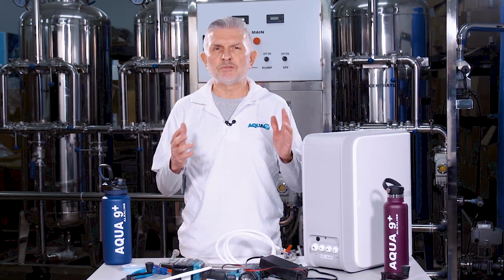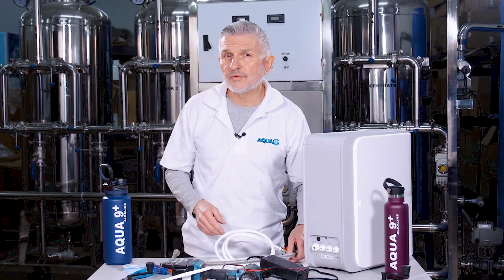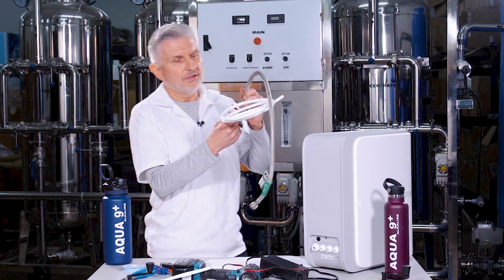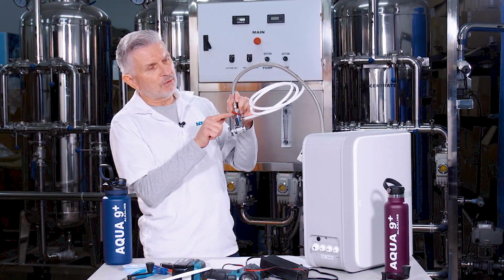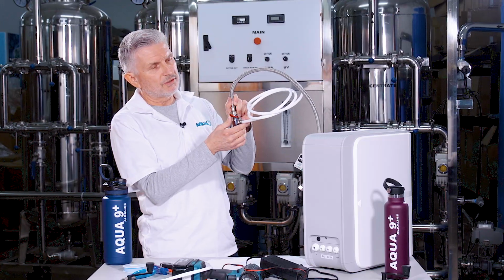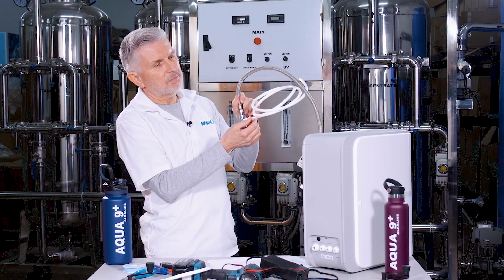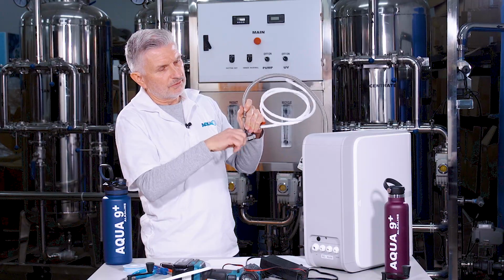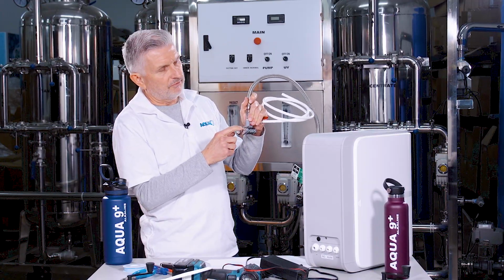Now that everything has been assembled, the next step is to turn on both the cold water source valve and the ball valve to the on position. Now, the ball valve, as you can see here, has a valve that's perpendicular in the closed position. So all you do is turn it 90 degrees to the right, so that it's parallel to the white 3/8 inch water line. And of course, then you want to turn on your main water line at the main valve here.